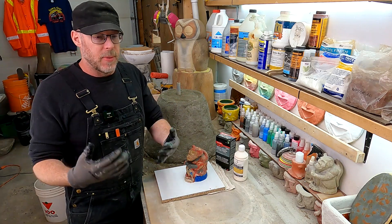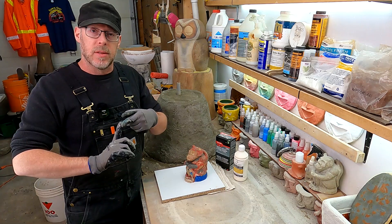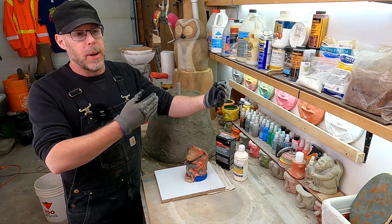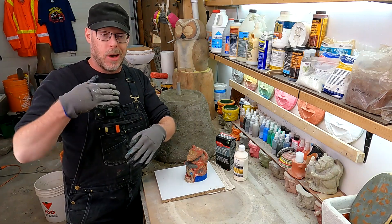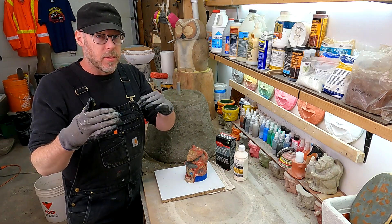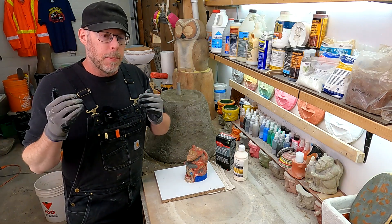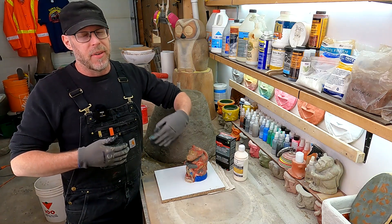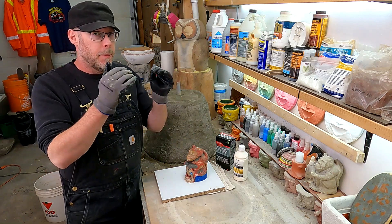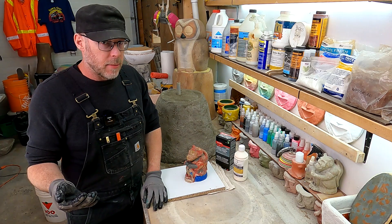The other approach actually incorporates patching all the broken stuff, but then overlays everything — patches and everything else — with something new. This enables you to add color, as mentioned, but also texture. You could have a basic broom concrete finish before, and afterwards have cobblestones or some sort of stone texture. That's what overlay is — a more permanent repair versus the very temporary, band-aid-like repair of just patching broken areas.